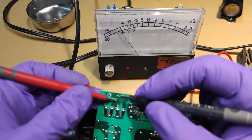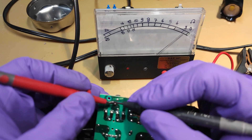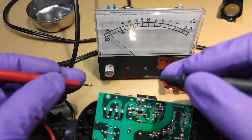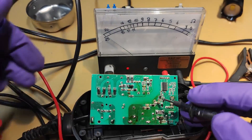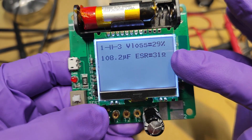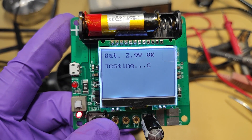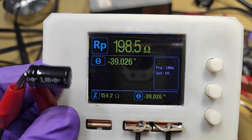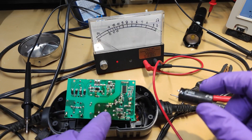Let's test those main capacitors — of course be sure they are discharged. Okay, contact is very dodgy. Okay, we have the same value. We have some other capacitors here as well. Okay, it doesn't want to measure — very bad. Okay, let's connect a replacement capacitor in place of those ones.